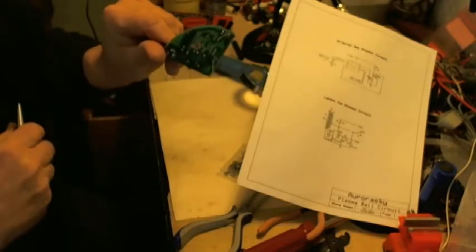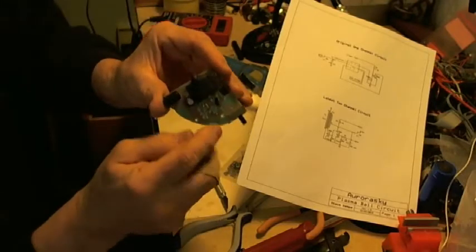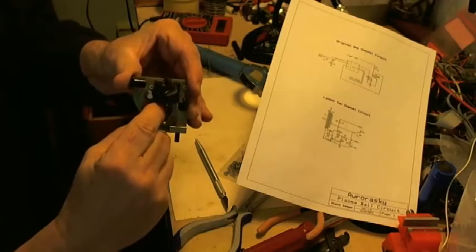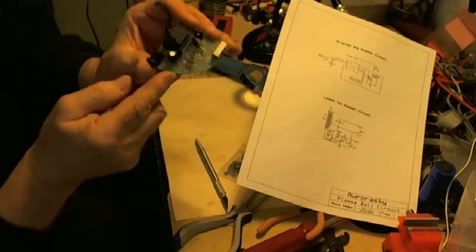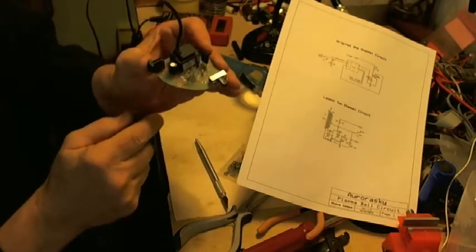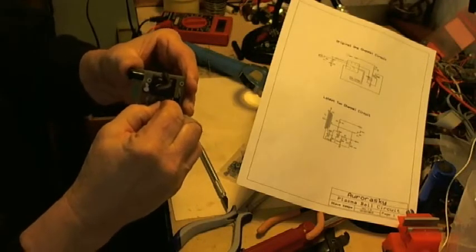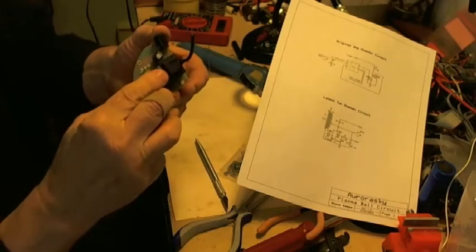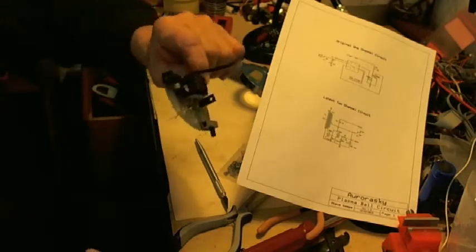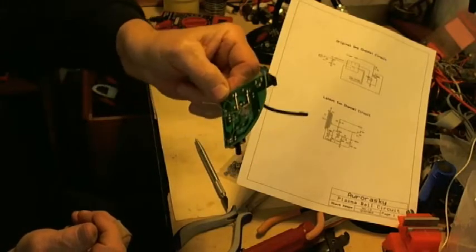I apologize. All right, so now I'm going to push these components in a little bit better. There's the diode, and I'm pushing it down. And the resistor, I had to mount vertically with one end and just stuck the wire through the hole in the other. I'm going to push the transistor down, to give me some leads to work with. And when I solder that, all except the two trigger wires will be mounted. And we'll do the two trigger wires in a few minutes.